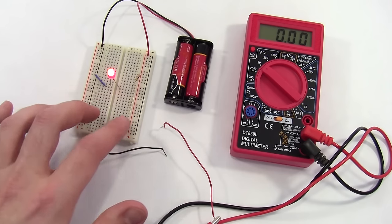When you are done measuring current, it is always a good idea to set your multimeter dial back to measuring voltage. It is much easier to accidentally blow the fuse when the multimeter is set to measure current. For example, if you tried to measure the voltage of a battery with the meter set to current and connected the probes directly with no resistance in series, you would easily blow the fuse because you'd get a lot more than 500 milliamps directly from the battery. So when done measuring current, set it back to voltage to be safe.